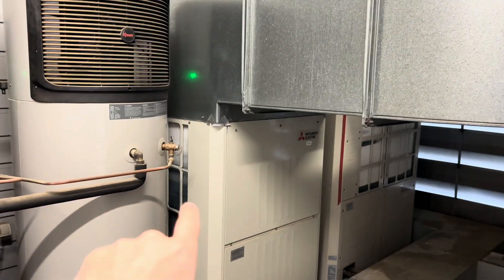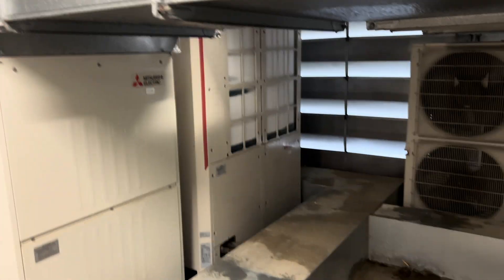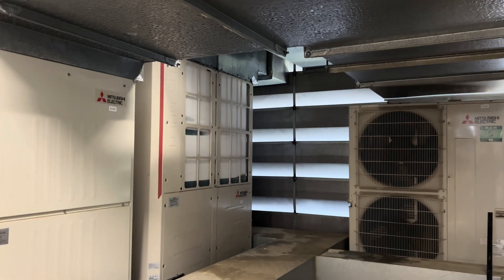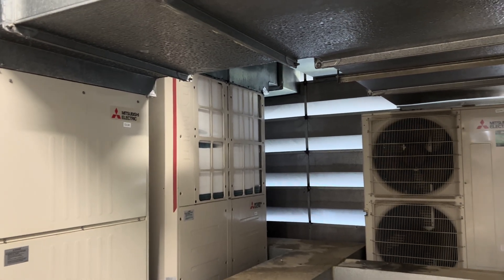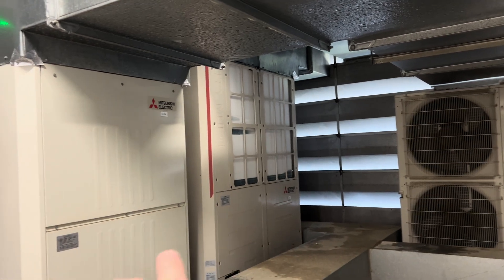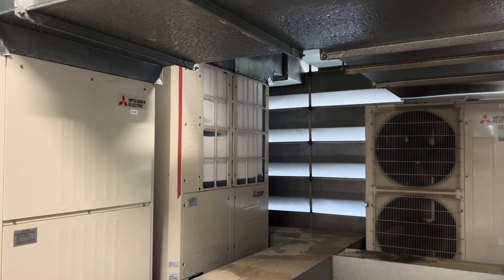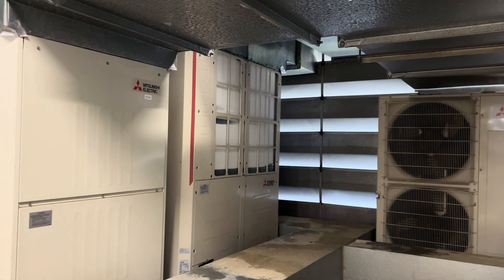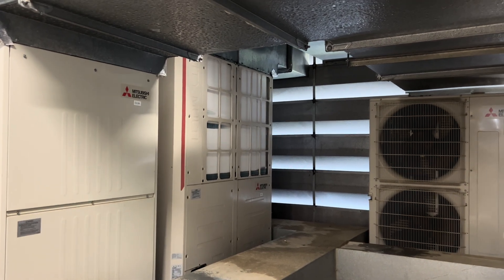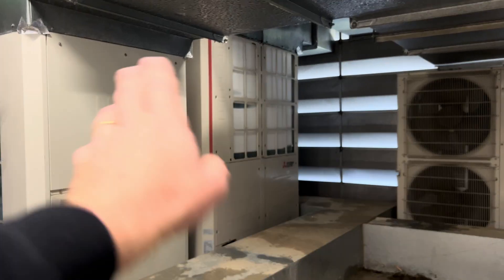That one had actually gone into a deep frost — it was frosting up all the way down the coil. So what we're going to do: I'm going to start with the blank thermostat problem first, then we'll jump into this. They've also got major temperature fluctuations — the heat pumps do the common areas but they're getting some readings from the thermostat and some from the return air. We'll jump into the thermostat first and then come back and look into this.